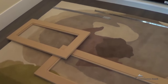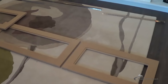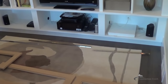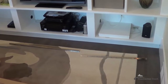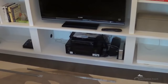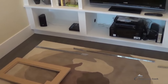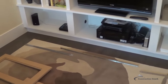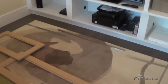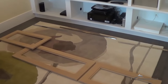So now I've got these three custom cabinet doors built. I've got the frosted glass ordered to go into that rabbeted joint you can see there. I'm going to use some piano hinges to mount across the bottom edge of the custom cabinet here. Once I've got them attached onto there, I will then individually attach the doors so that I can check the fit before I put the final screws in the bottom of the door to go across. So I'm gonna get going with that, and then I'll get off to the next step.